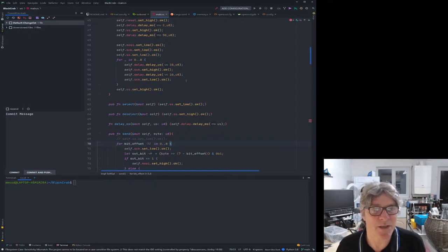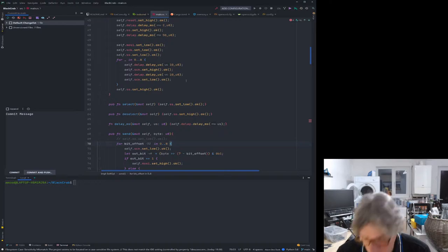So basically what I want to do is have this SPI code, written in nMigen, running on the iCE core, that basically takes a byte from SPI to start with and displays it on the LEDs, or four of them, the LSB of the byte.